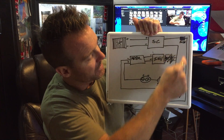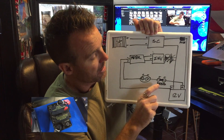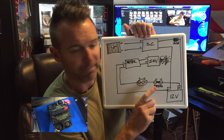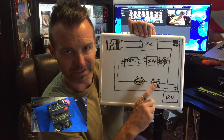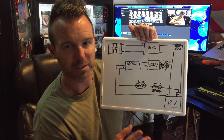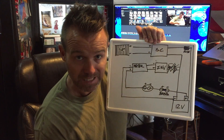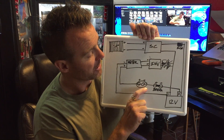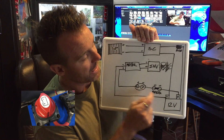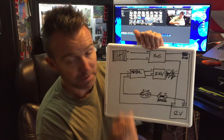On the positive side, you run through a breaker off of the battery. This is the fail safe I mentioned — this breaker will trip if there's a short in the system, if it's overdrawn, or if there's a load beyond the capabilities of the system. Then I've got my switch, which disconnects the hot side of the battery from the inverter. Both run into the power meter, and from there to the inverter — and happy little electricity comes out.